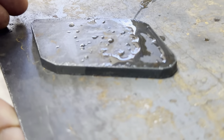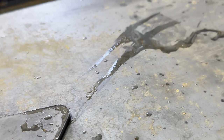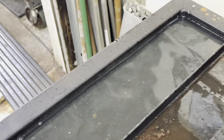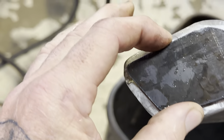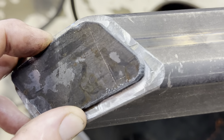Alright, that's a little warm — this is right off the table. We're going to look and see what our dross is on that: very, very little. Now we'll come over here where it counts. It's a little warm, so let me do a quick little dunk. A lot of times I'll run the water just a little higher. We'll take this over here and figure out if that's going to be a decent part — and we'll lay that in place. Pretty much, that's exactly what I'm looking for: a place for the weld to lay in there.